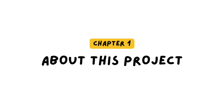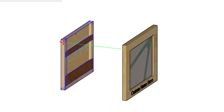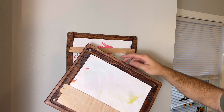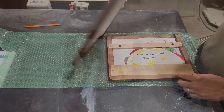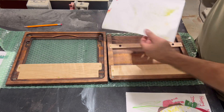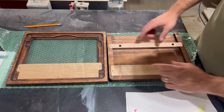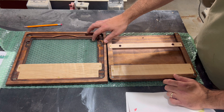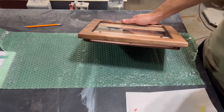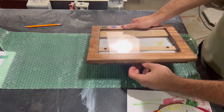Chapter 1: about this picture frame. Like most of my multi-component CNC projects, I designed everything for this picture frame within SketchUp. I knew I wanted it to fit standard sized computer paper and display a single photo in the front while also storing extra artwork in the back. At first I thought I was going to use a hinge to hold the two parts together, but then I realized that magnets would be a bit easier. I added a magnet into each corner of the two main components and used screws to secure the storage rails as well as the front acrylic cover. I added an opening in the top for easy access so I don't have to remove the front cover every time I want to add a new piece of paper.